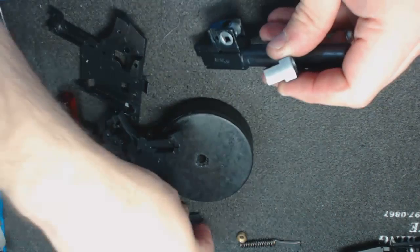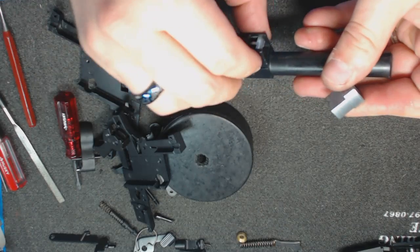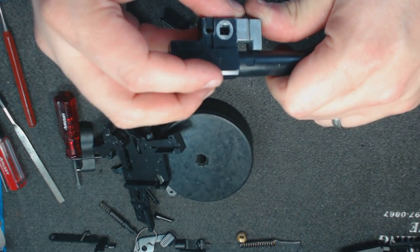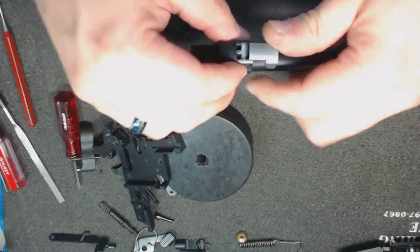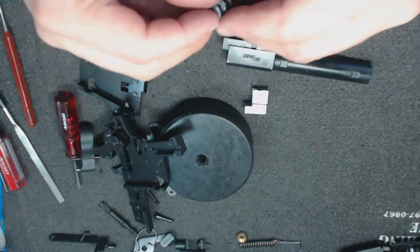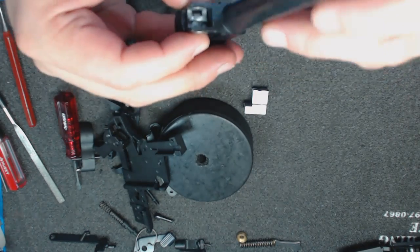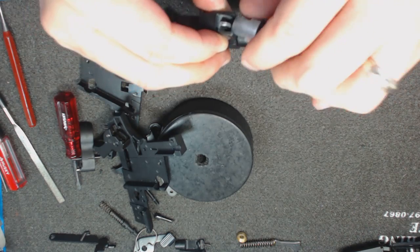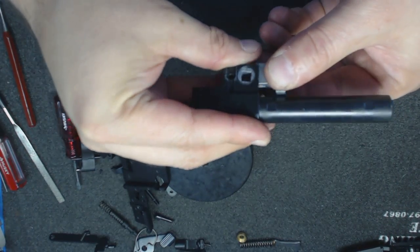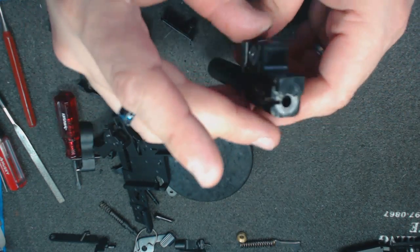I rotate this around. It's actually hard to rotate without the piece. So in this position, you can see how much further forward it is. You've got almost a half inch there, and then when it's rotated the other direction, significantly less. So anyway, putting it back together, we just want to put it back together in the disassembled state so that we can get it back on the gun and leave enough room for the screw to get through there in the end. And that's pretty much it.